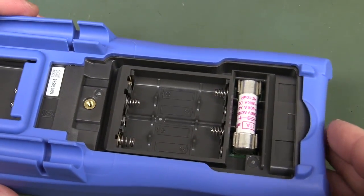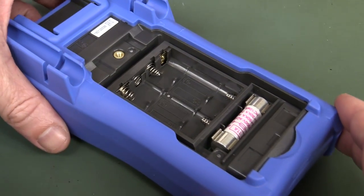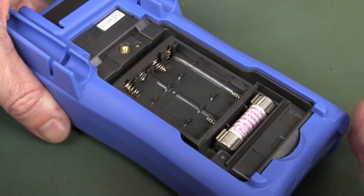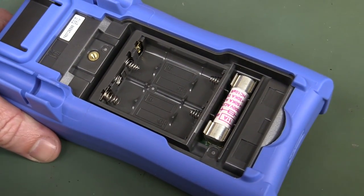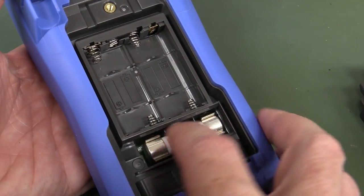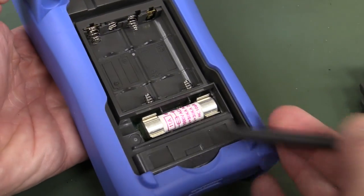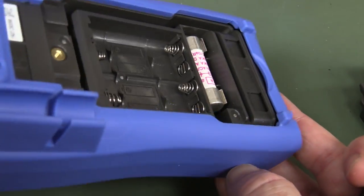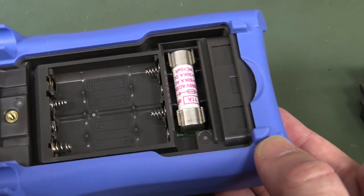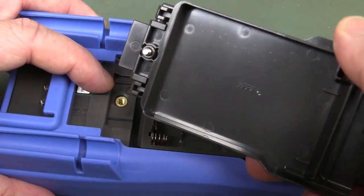Unfortunately it doesn't have microamps, so to my mind it's usable as an electronics meter — it just doesn't have your typical electronics-meter microamp functionality. There are nice deep grooves around the side to protect it. The big HRC fuse is all in its own little enclosure, so if it releases the magic smoke it shouldn't do too much other damage. And of course machine-threaded screws, as you'd expect — none of that self-tapping rubbish.